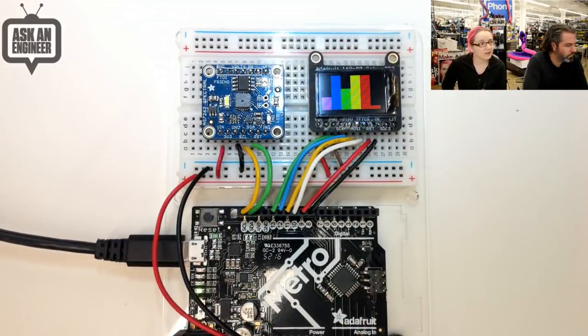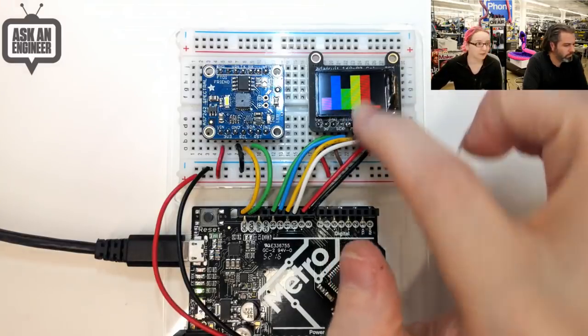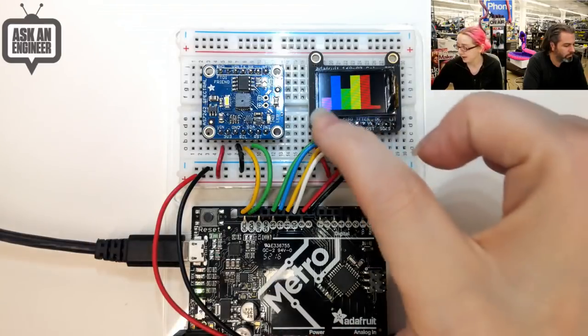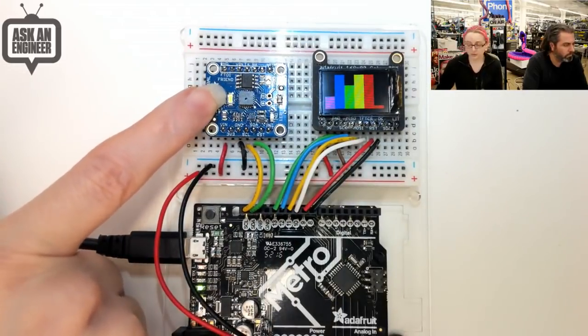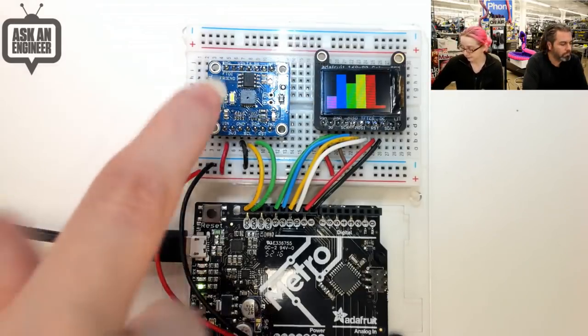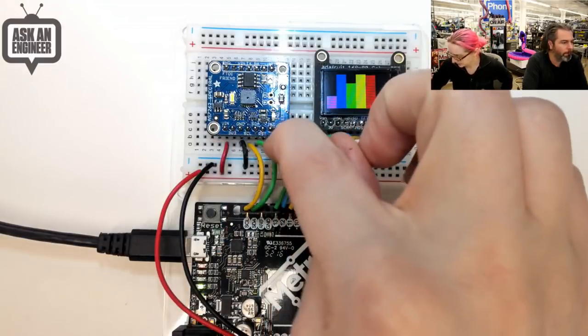It's a very bluish light, so you see the blue bin and the yellow bin, because it's LED light — basically a blue LED with a yellow phosphor coating — not as much red and not as much purple. We added a full spectrum LED on here, but this demo doesn't show it because it would just blind you. It's a 5700K color temperature LED that you can use to reflect off objects, as the datasheet specifies.